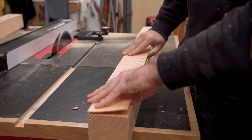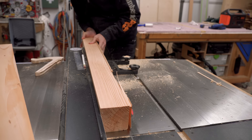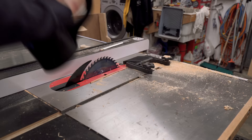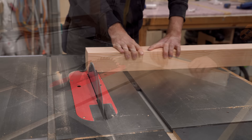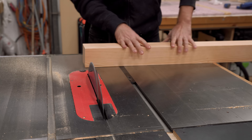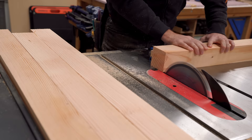Now that I knew all the posts were square I could then cut them to size - two passes on the table saw brought them in to that three inch mark I was looking for. Next up I need to clean up the ends of the posts and for that I'm going to be using the Rockler Precision Miter Gauge. This is not only very precise, it also allows me to cut them directly on the bed of the table saw which means I get the full three inch depth of cut I need in order to cut all the way through.